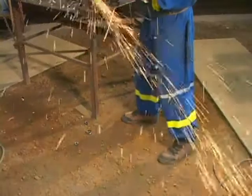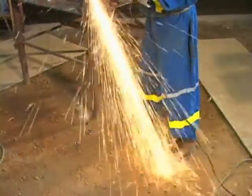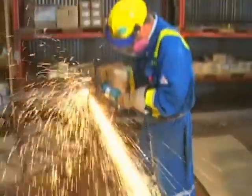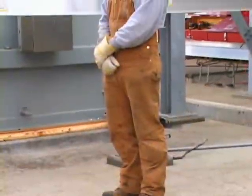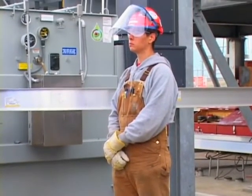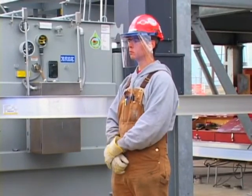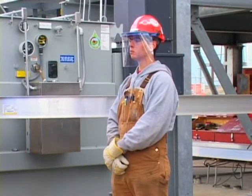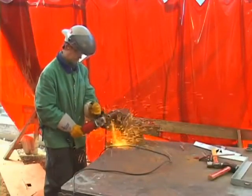Be careful about outer clothing. Anything that could snag or catch fire is dangerous. Wear long sleeves and tuck in shirt tails. Do not wear loose-fitting clothes. It's best to wear natural fibers like cotton, as synthetics like polyester are extremely flammable. Always remember that PPE, personal protective equipment, is the last line of defense and does not replace the use of safe work practices for grinder operation.